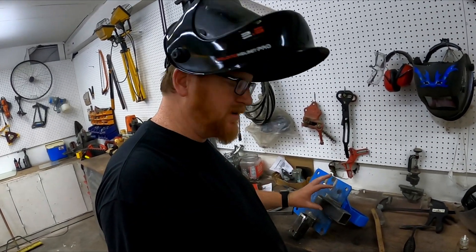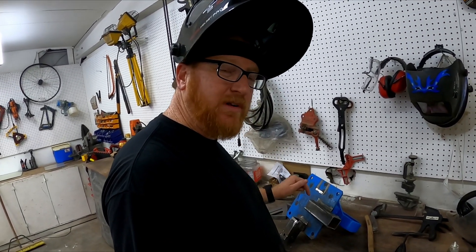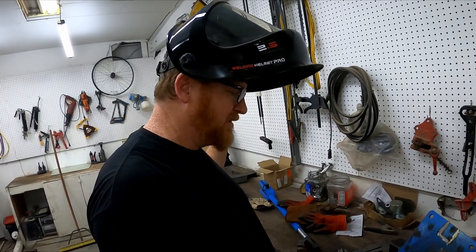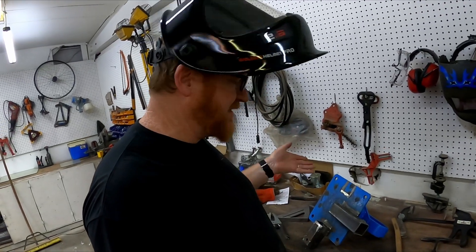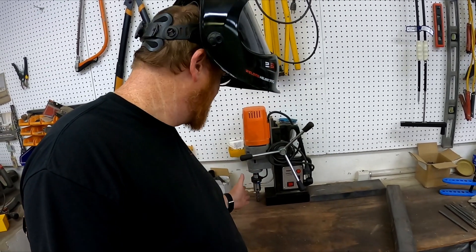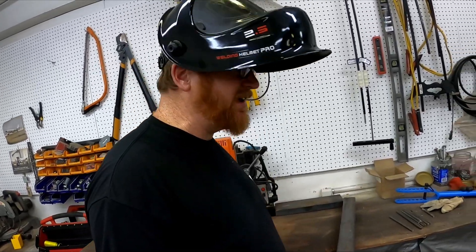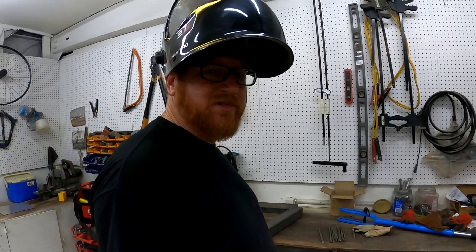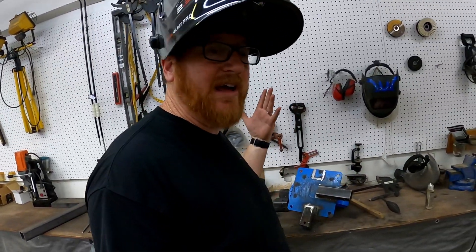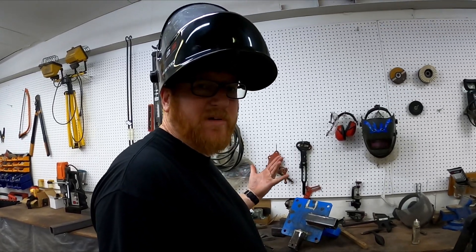I'm using some scrap 2-inch receiver that I had. We drilled these up one step from 5/8ths — I believe that's 21/32nds. The magnetic drill press is awesome, it's a game changer. Not having to be over these holes for minutes at a time, it goes through in about 15 seconds. If you can get set up with annular bits, they're supposed to go about 300 holes before you wear one out. On a twist bit I'm sharpening every 10 holes when going through 3/8ths material, so that's such a time saver. Those bits are so sharp they just eat right through — keep them oiled up and they last a long time, and they're within about 10% of the price of a good twist bit.